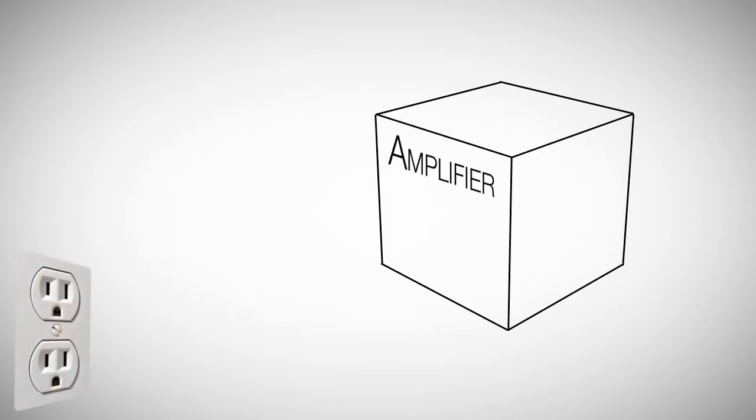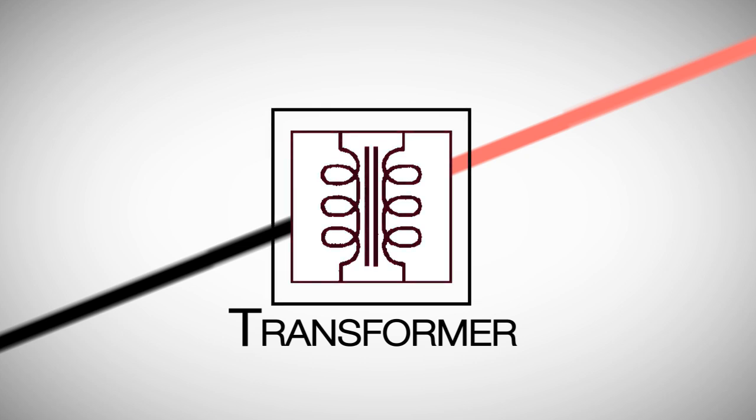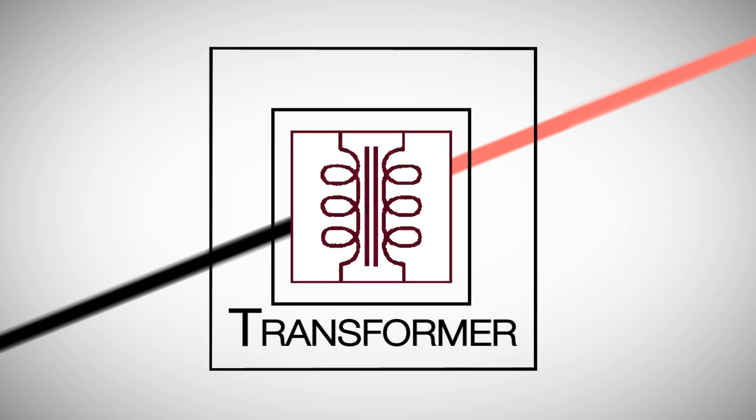Here's how it works. The electric current arrives at the transformer inside the amp where the voltage is literally transformed or reduced to the amp's operational needs. This transformer is insulated twice so that it is simply not possible for any of the live electricity to connect to the secondary electronics or the housing.